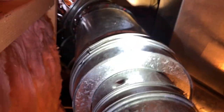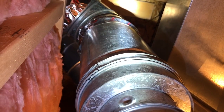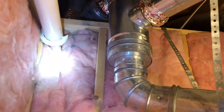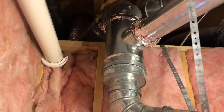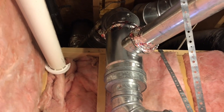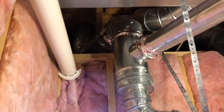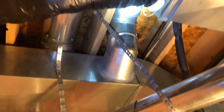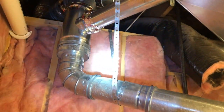Make sure the vent is at least one inch away from any wood or anything, because when it gets hot and it's touching the wood it can cause a fire. A professional told me if it's touching any wood you won't have a fire right away, but it will happen and you'll burn your house down. He had it touching the wood and I had to lift it up — you can see these straps that I put on here lifting it up.